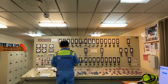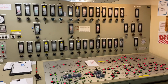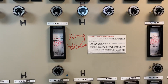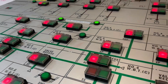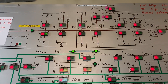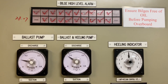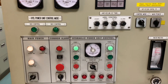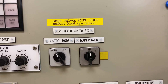This vessel is equipped with a valve control console. Normally for newly built vessels the system is already incorporated into the control and alarm monitoring system. You will find in this console the ballast tank level gauges, controls for opening and closing your ballast valves, bilge level alarm indicators, and pressure gauges for the suction and discharge of your ballast pump and anti-heeling pump.